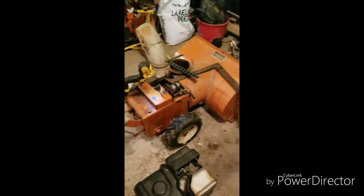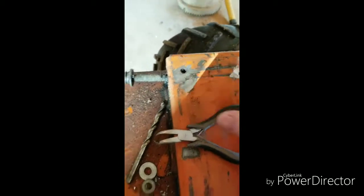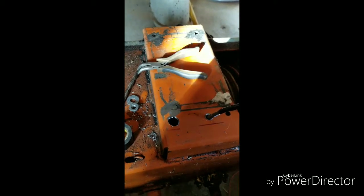We put that motor up on there, got our center mark that we made earlier, lined it to the center of the left side of the shaft, put it up there, marked the right side hole, and got one mark there on our side. Got to transfer it out into the middle and measure over to center. Got that one drilled. So we're going to get the other hole drilled right here, do the same thing — this shaft hopefully won't be in the way too much — get that one drilled, get our bolt up there, get the motor kind of mocked up sitting up there, get a belt on her, and see if she's even going to work.